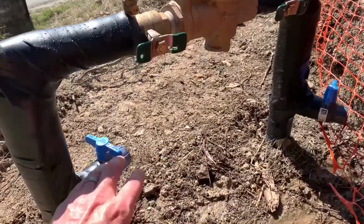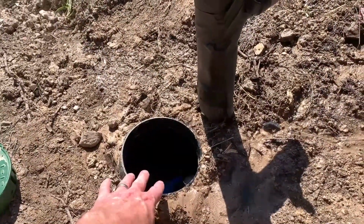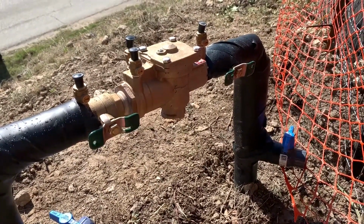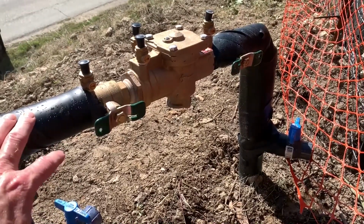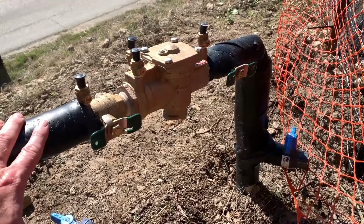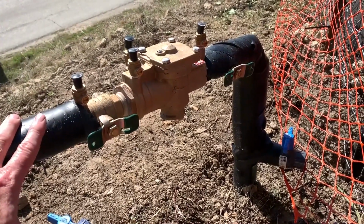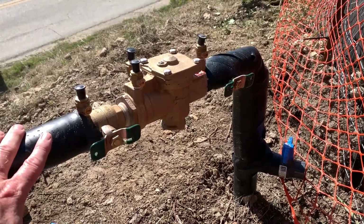If for some reason you don't have these drain valves, what you want to do is close the isolation valve and then turn your system on for about a minute. Then you can turn it off. That'll pull some of the water out of this and help with the freeze. You always want to make sure to turn your controller to the off position and not run it without water in the system. Hopefully these tips help. And if you have any questions, just leave a comment below and we'll get it answered.